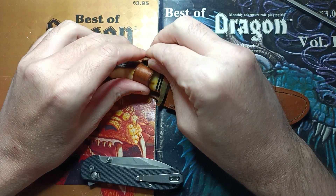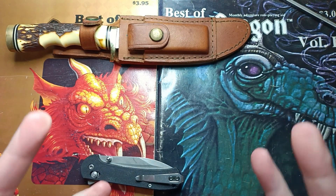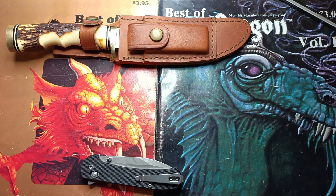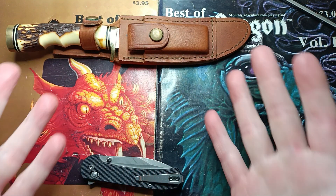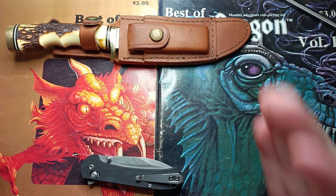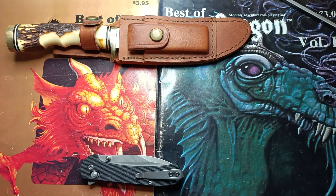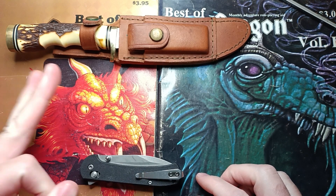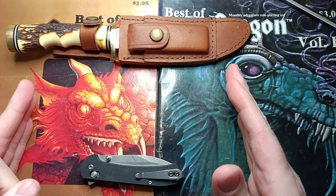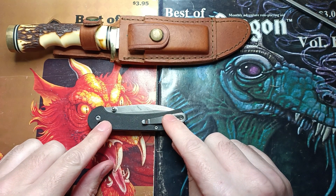So I got to wondering — because this is some old steel, old Schrade — we've done 440 from the 1980s and other comparable steels that did not perform this well. The question was: was it that 18-degree edge profile I gave it, or was it the steel? I had no other way to answer it, so this Ozark Trail got the edge reground to 18 degrees and we went in on it.